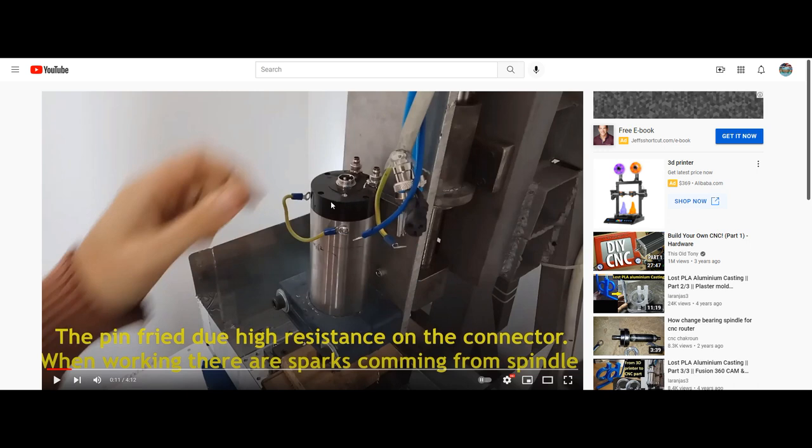The other area of concern I want to discuss, and I want to bring up a very logical point because I deal with this all the time, where potential clients and clients ask me about properly grounding their spindle. This individual took a ground lead, and he came right over here to the spindle body, which is stainless, and tapped into the spindle body, which is dangerous in itself because it's the external part of the spindle motor.